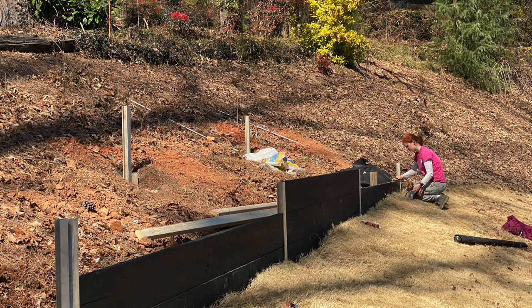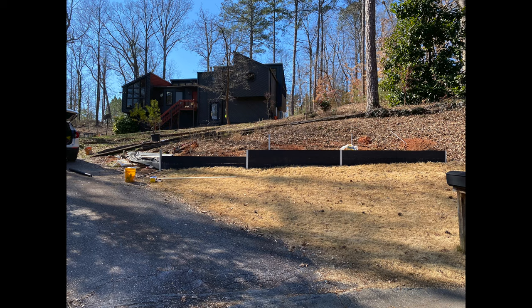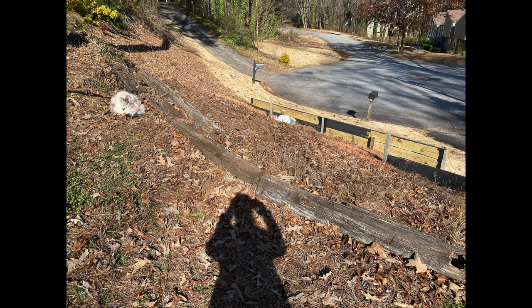We've brought in a landscape fabric roll sitting on the driveway. Not all of these boards were stained, so I needed to go back after the fact and stain the backsides of some of these boards. I prioritized staining the part that would slide down into the C-channel since I wouldn't have been able to get to that later. I can also see four by fours in the middle of the two by tens, between the aluminum pieces — those are tiebacks that we're putting in. We also made holes for those, so those are going into the ground, concreted as well, and we're screwing through from the backside so you don't see the screws on the face.